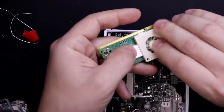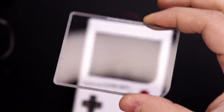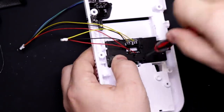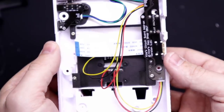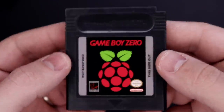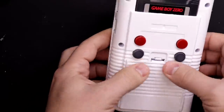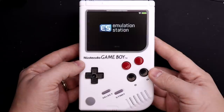The kits used to come with fans, but now that's optional — it does come with a heat sink though. For attaching the screen lens, I just used some thin strips of double-sided tape. I added a second L and R button board for L2 and R2 so I can play PlayStation games, and I modified the printed part model for this. There's also a long thin board on the side with a USB port and a mini HDMI port, so you can play it on your TV with a USB controller. As I said, quite a bit more work involved in this build, but you could still do it in a weekend easily, and I love the customization options.